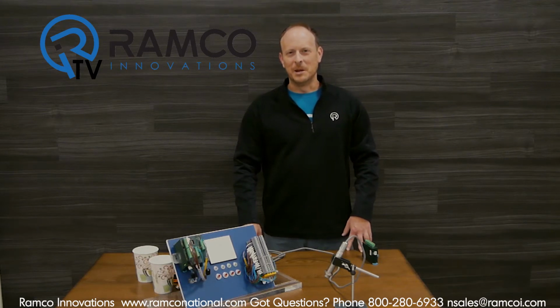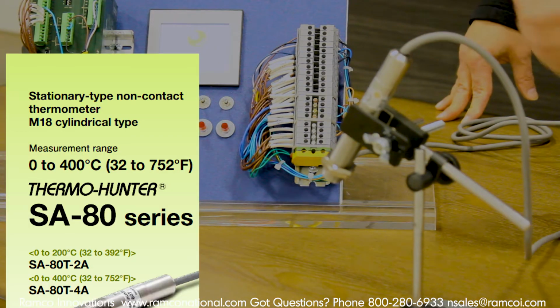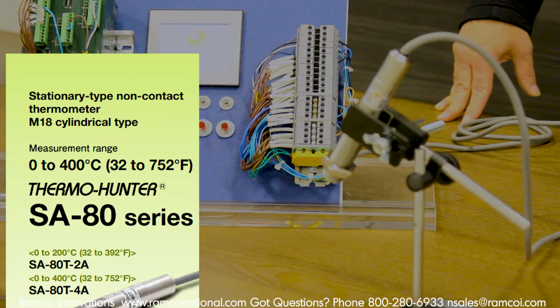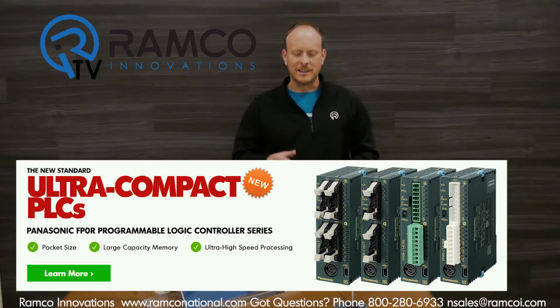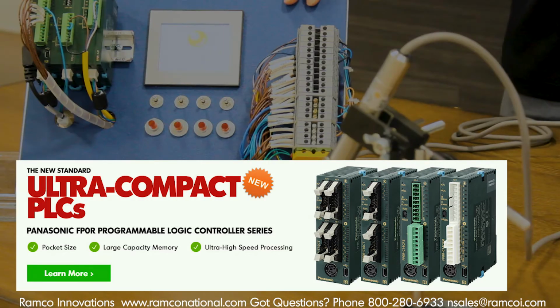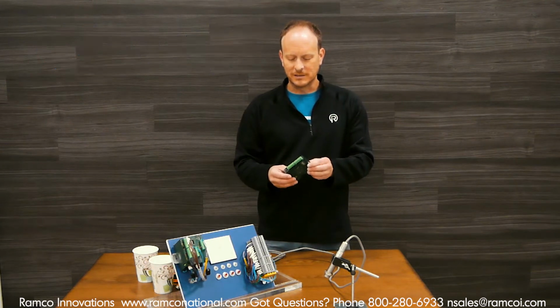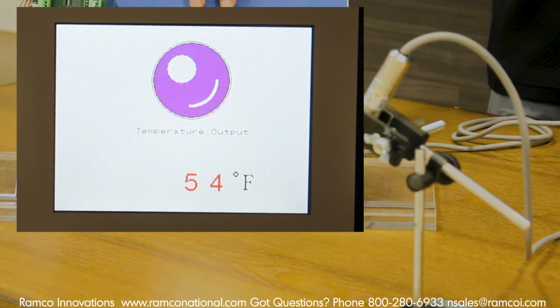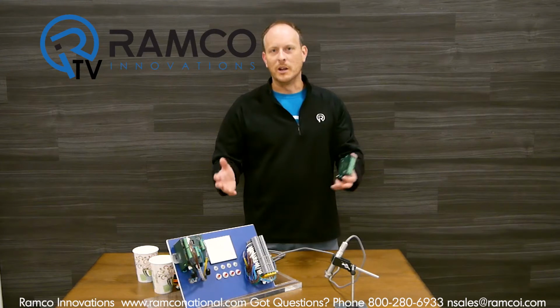In this video, I'm going to demonstrate the new industrial infrared temperature measurement sensor from Optex FA. This particular sensor, the SA series, is self-contained with a 4 to 20 milliamp linear output proportional to temperature. To interface this today, I'm going to take the output of the sensor to our Panasonic FP0R PLC with analog input card. This PLC is a really nice, small, compact PLC, and I'm going to interface that with this Panasonic GT series color touchscreen. It's also a very nice, high resolution color touchscreen. So let's go ahead and see what this sensor can do.